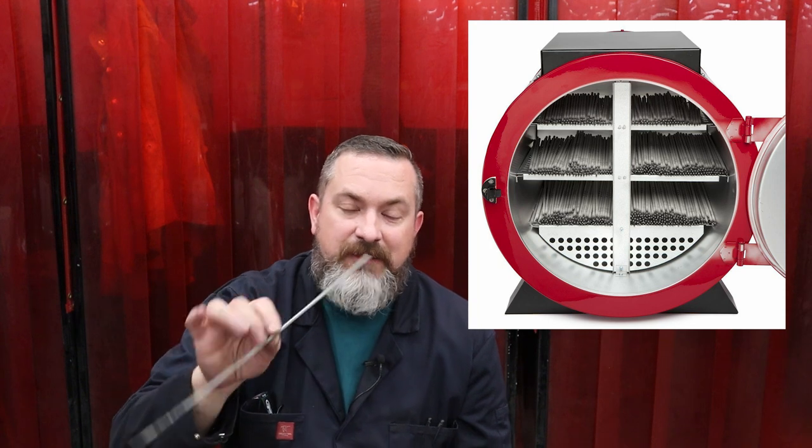Where does all this hydrogen come from? We have hydrogen in our atmosphere that can be drawn in. We can also have material we didn't clean properly, with oils, greases, and paints that burn off and make hydrocarbons and hydrogen. But the really big culprit is when we leave electrodes lying around - they absorb moisture, which is H2O, and when we burn that off it gives off hydrogen right at the source where we're depositing metal.